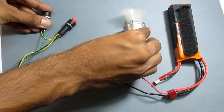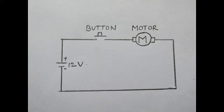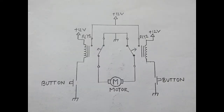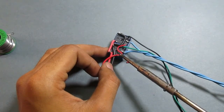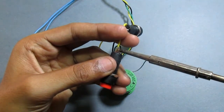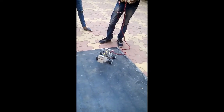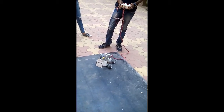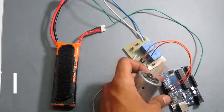In this without-microcontroller circuit, I have interfaced the motor with a LiPo battery through relays and buttons. I can do it without relays, but small buttons are inconvenient for handling high current. Here is the circuit diagram — I made it in a simple way without any PCB. In India there are many robotics events where you can use this in your robot to give maximum power to the motor and win the game.